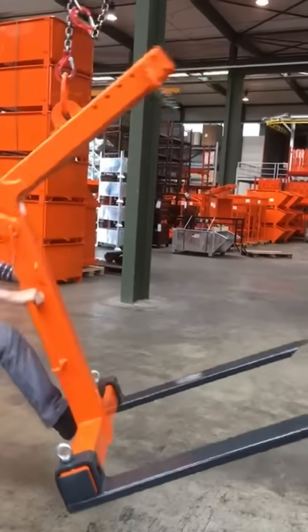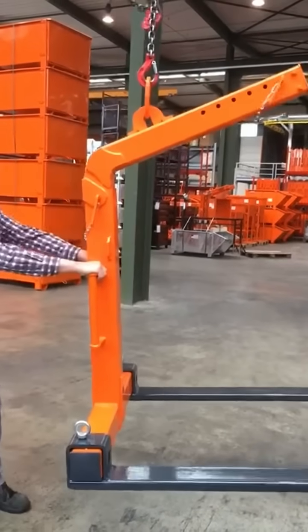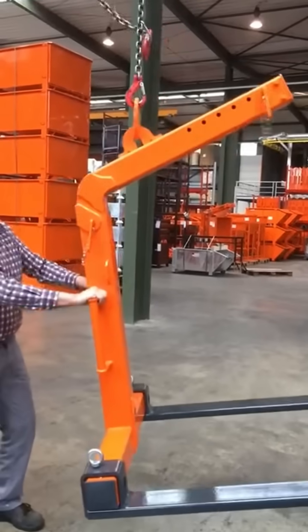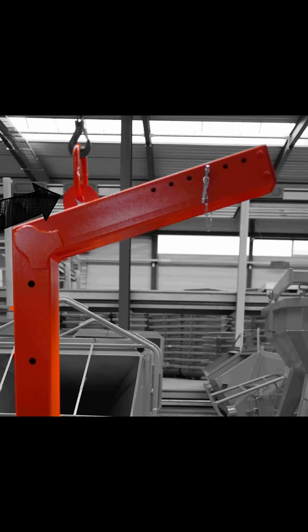When you utilize this trick, if the load is under 20% of the full capacity of the forks, you have to remember that you need to secure the trolley forward, and you do this with a pin. Get the trolley forward and then put the pin behind it so that it can physically not come back.